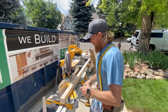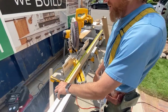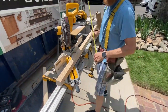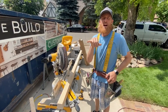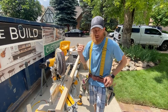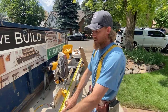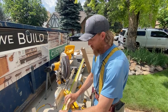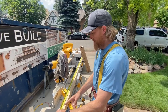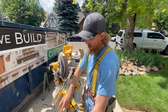We know after shaving it, we're right at 73 inches, okay? Now on the handrails, code is 4 inches in between balusters. So it cannot be any larger than 4 inches between balusters. So let's start out with 4 inches. What is 73 divisible by 4? Well, we know that 72 inches is 18 balusters, 18 times. So that would be 18 balusters for 72, but we're at 73.